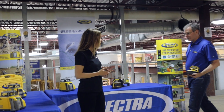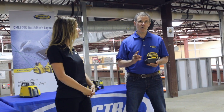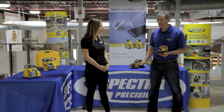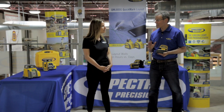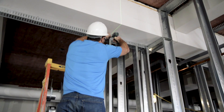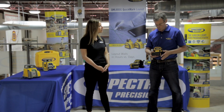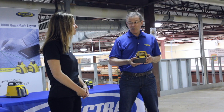We have Tom Campbell here today to share a little bit about these lasers. We have four products in our laser tool family, each available in both red and green. The LT52G here has a vertical laser line, a horizontal laser line that extends 220 degrees, and five bright green laser dots. The dots are so bright you can see them from 200 feet away. The combination of lines and dots makes this a practical choice because it covers all laser applications. It's designed with an offset with a two-inch clearance so that the LT52G clears a floor track without the aid of an additional accessory — very convenient on plumbing walls.